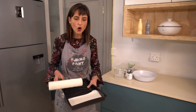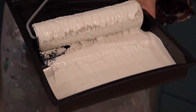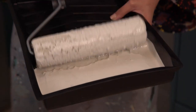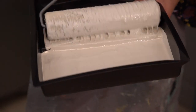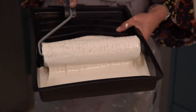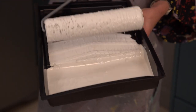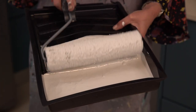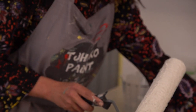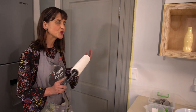Lebo is a warm, neutral colour. It's not a cream, it's not a grey — it's a warm tone. It complements anything else, but it's lighter than Vinyastone. So I generously and evenly roll my mohair roller in my Lebo's Light — I've already poured some in here. Choco colour: Lebo's Light. I am going to roll it onto my door surface. Large flat surfaces — mohair roller for a very even, smooth application.